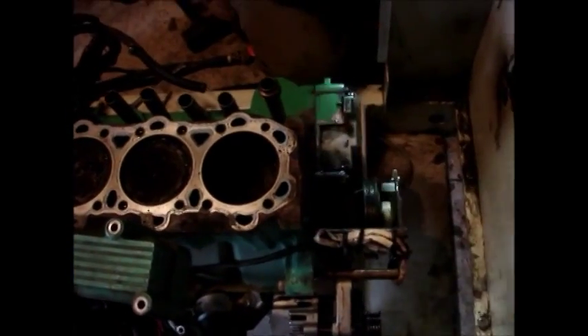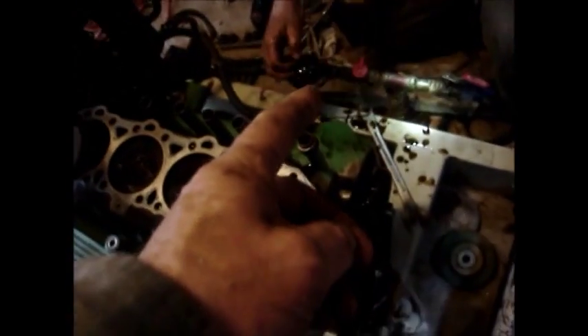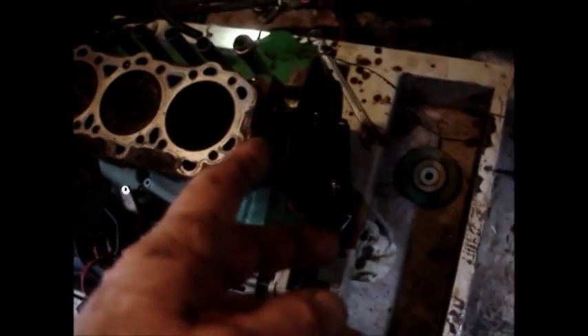Because we have to remove number one, we have to remove this front assembly because there is a piece of the oil pump assembly that's in the way of number one. Surprisingly, we didn't have to remove this cover to get this strainer and pressure relief valve out — the book says you do, but you can get those from the engine crankcase side.